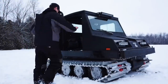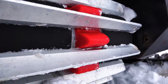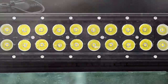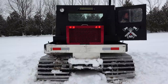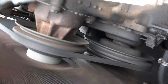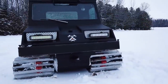These are the upgrades: new paint job done with a grinder and spray can, vinyl stickers to display the outsider crest, polyurethane drive sprockets, LED headlights, and light bars on the front and back of the heated cab. Not to mention the engine, which was upgraded before I purchased the snowcat. Originally it had a 1.6 liter Ford engine with manual transmission. Now it has a 2.5 liter Iron Duke with automatic transmission. What was once a cute little Happy Meal has now become the snow tank.